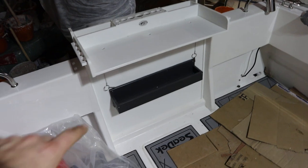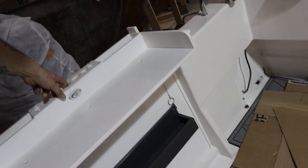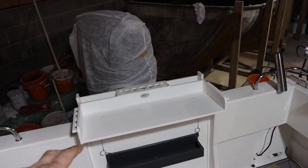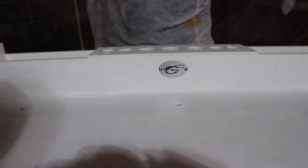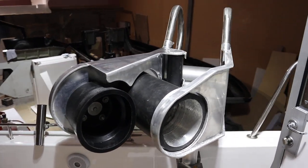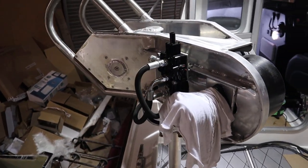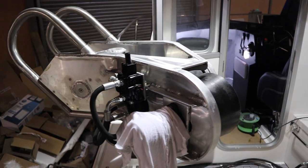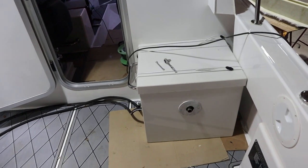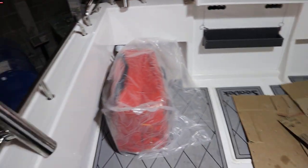The bait table has a back pocket and it actually slides in and out as well, so you've got options. It also unmounts from the top here so you can grab it and take it away. The customer wanted this specifically because he's also had a commercial net hauler installed — made by Sovereign Workboats, bolted into the gunnel and into the floor for getting commercial nets and gear up over the gunnel. Here is a power pack that powers the net hauler — a little custom GRP box with a donkey engine inside and hydraulic pipes leading round to power it.